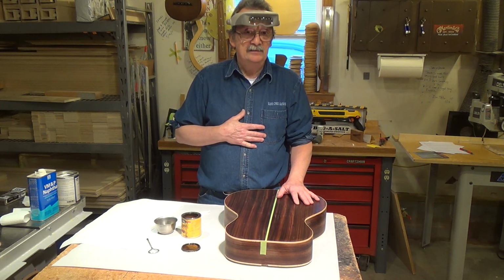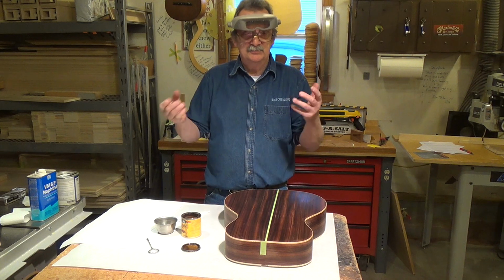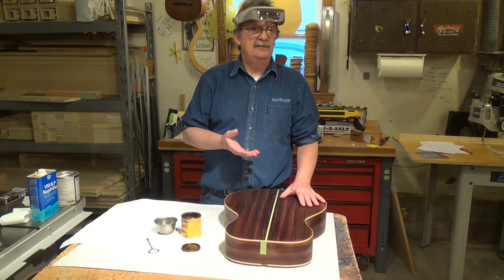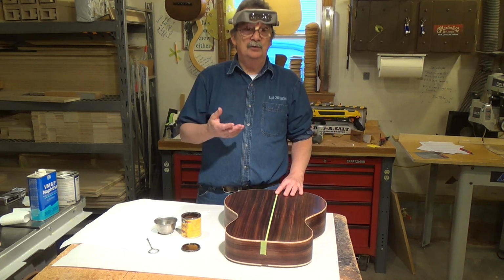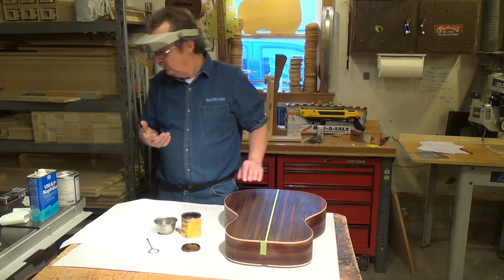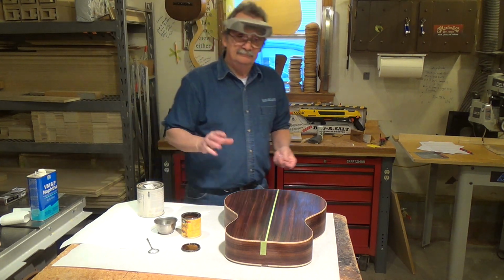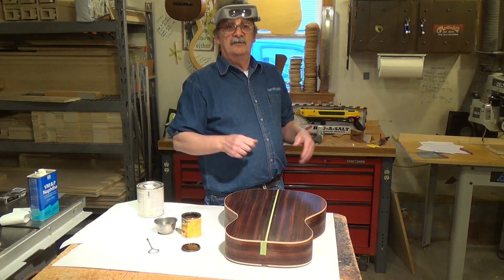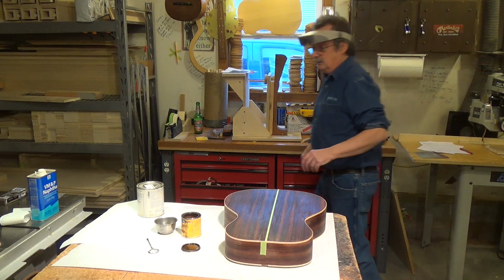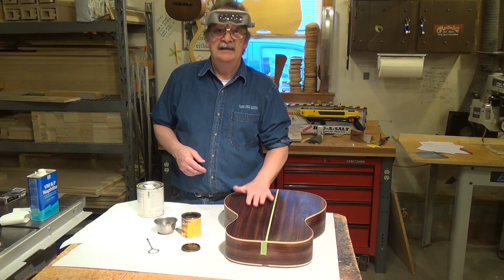What we did do when we did use super glue is we hit it almost with pure acetone out of we had 2 sprayers, mixed it, hit it with acetone, and then shot lacquer right on top of that, and that seemed to work fairly well. But super glue off gases, and it's kind of a foul odor, something that you probably really don't want to breathe a lot of. But let's just do it outside in the middle of a hurricane or a tornado, you'll probably be fine. Now I will mix up enough filler just to do one part and then the other.